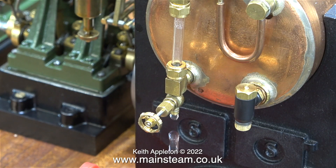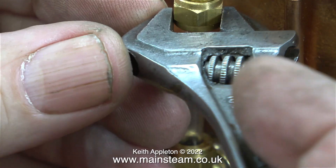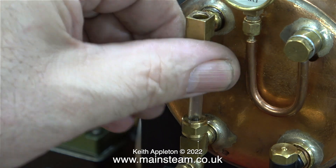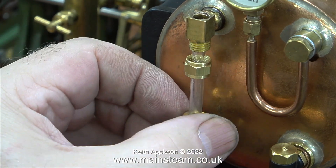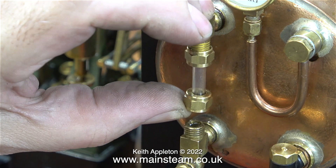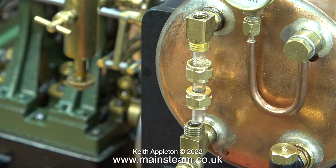Back in the workshop, I've been draining the boiler using the blowdown valve on the water gauge, with the water running into a small plastic box. During the steam test I noticed something wrong with the water gauge — there was always a tiny bit of water around the top part of the bottom nut, and when I tightened it, it didn't feel right. I suspect it's not aligned properly and I have a sneaking feeling the bottom of the glass is broken, so I need to remove it to check.